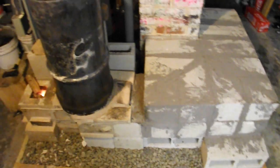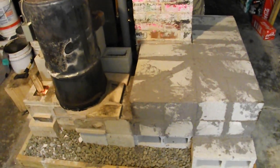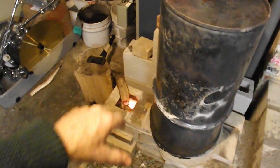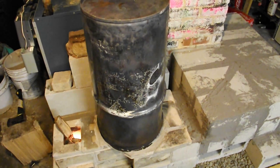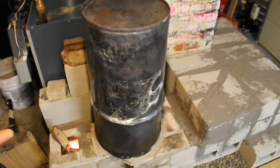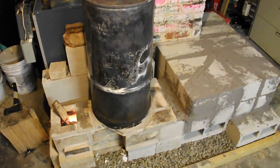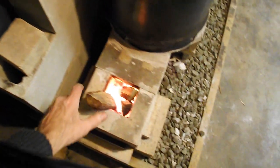If there's any criticism I have about the way this thing is working at this point, it's that that thing is probably too hot to sit on for long. So I could certainly increase the thermal mass. My plan at this point is to add two inches of coarse lime plaster over the entire surface here, and again to cob in this end to make it a more useful and safe at the burning end of this thing. But other than that, I'm just very happy with this. It seems like it's safe, it's possibly legal, it seems environmentally responsible, and it was well under $200 to construct with a fair bit of labor from my boys. So overall it just seems to be working out very well. I'm going to quickly take a peek upstairs and see if there's any smoke coming out of the chimney, just carry the camera up the stairs and outside real quick and we'll just see if it's as clean burning as I think it is.